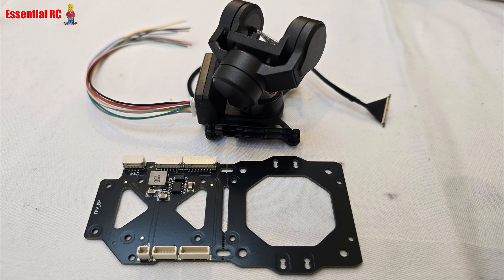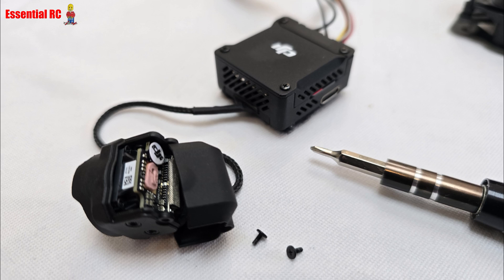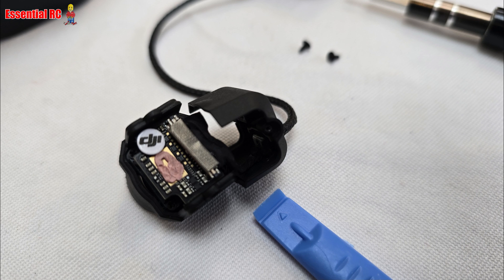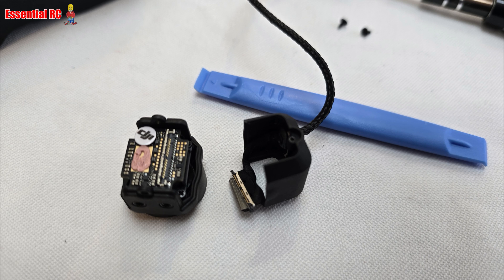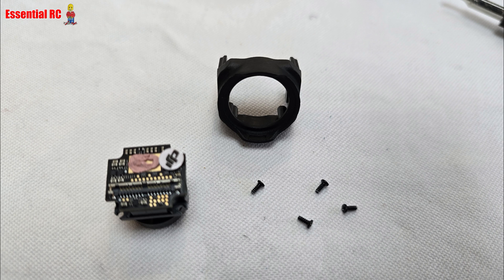Here's the gimbal out of the box with the backing plate from the accessories pack. First, bolt the gimbal onto that mounting plate. Next, take your DJI O3 FPV camera and VTX and remove the two screws on either side of the back of the O3 camera. With the back removed, use the insulation tool to gently lever off the plug for the wire to the VTX from the back of the camera. Then undo four screws so the camera itself can be pulled out of the front part of the case.